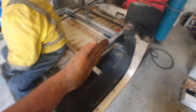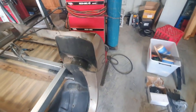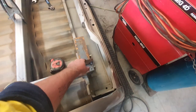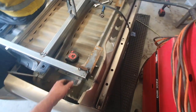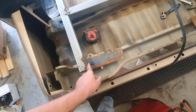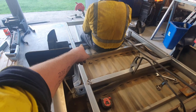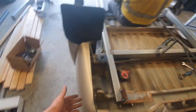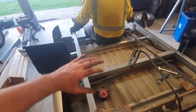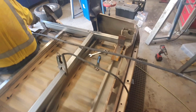Got a bolt. It's just flat, it's angled, that comes down and loops under the box, and then we've just pinched it into the standard mount. It's 75 by 6 flat bar, and I just put a fold in it at work in the bender. So we did the same to the back, but instead of going under the frame, we went out. We did space up 40 mil to keep it level. So we've got the tub level on the concrete, put a level on top so it stays the same, so when we flip it, it's not nose down, ass high, whatever you want to call it.